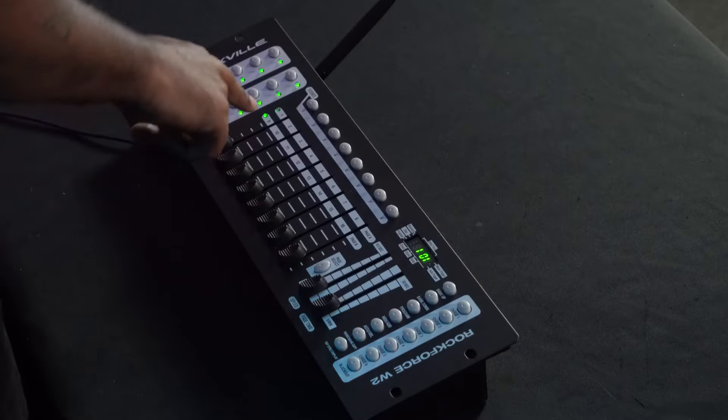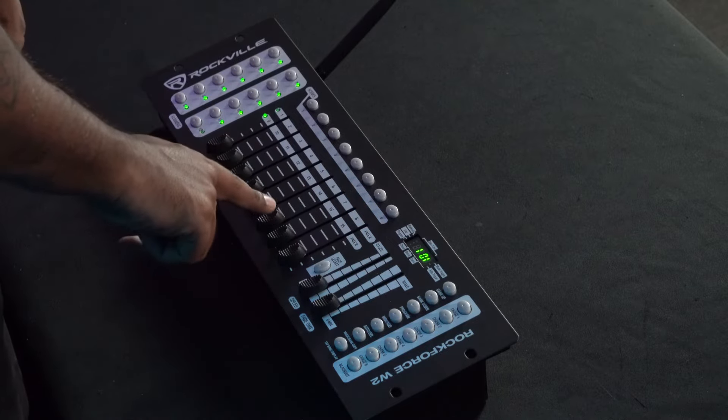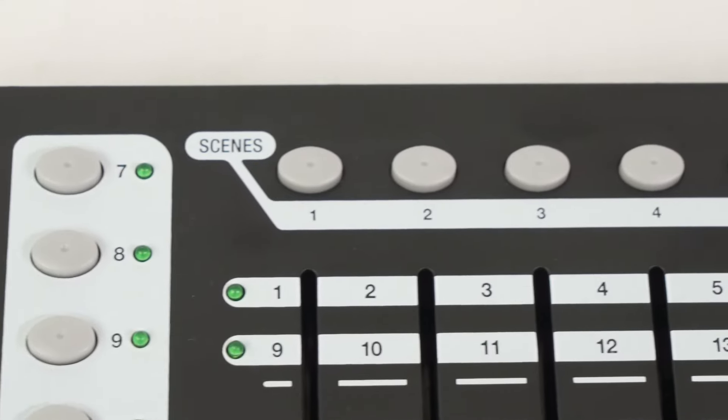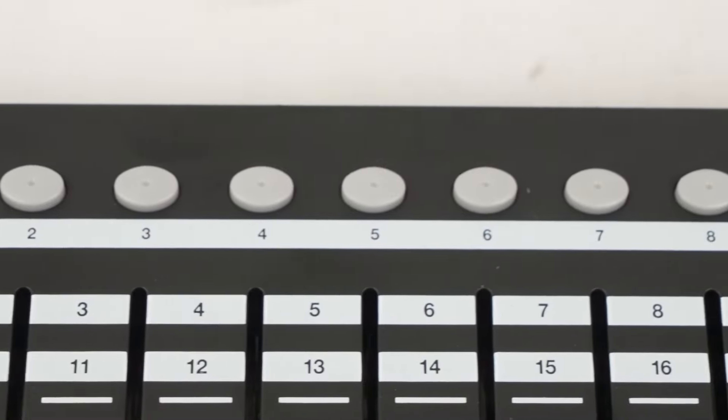For example, certain lights have different effects and presets mapped to different DMX channels. Let's say in 16 channel DMX mode the strobe function is controlled by fader 15. If I want to access fader 15, I go to page select to make sure I'm on page B, and then I can use that fader to control fader 15. If that sounds too technical, don't worry — we'll explain it all once we connect our lights. Now above our faders we have our scene buttons.